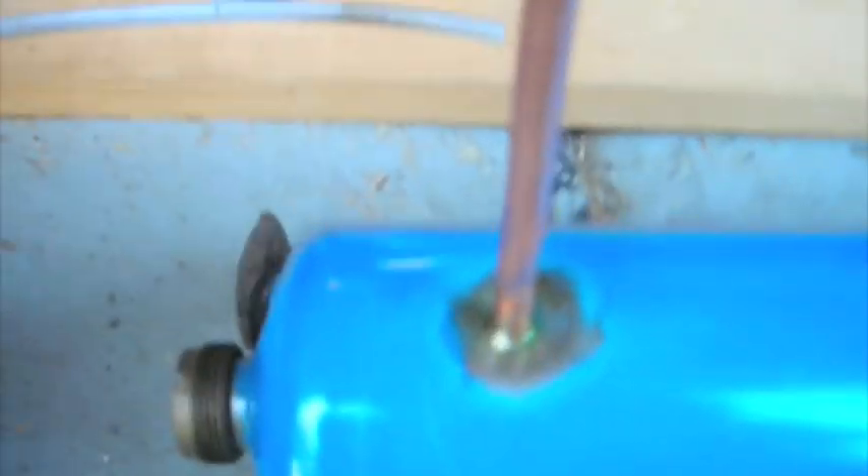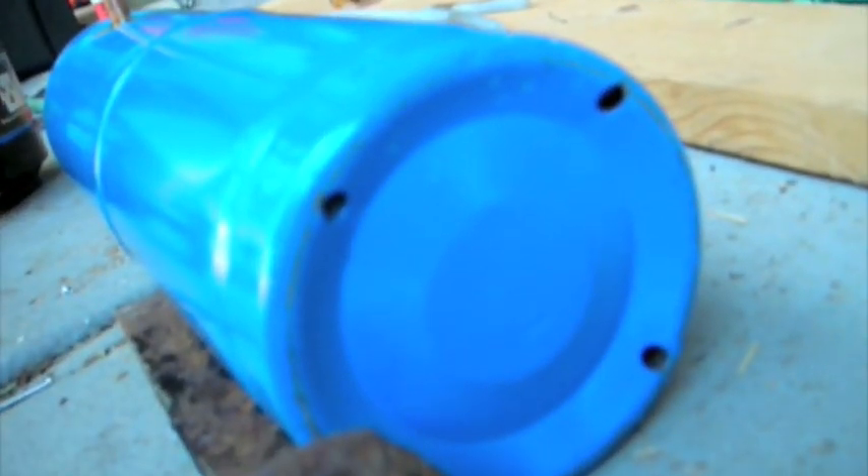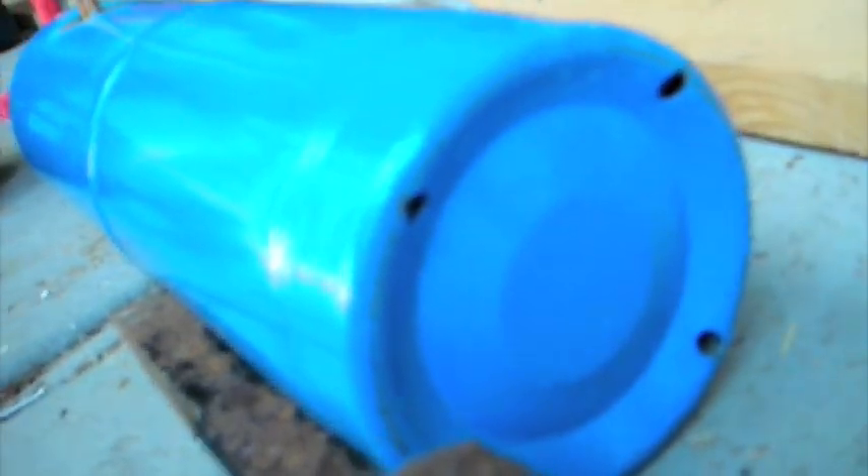Okay, let that cool. Just put a nice little bead of solder around there. Now I'm going to make the fixtures up here, and then I'm going to have to make a sight glass in the back, like my old boiler. That's probably gonna be tough because there's a two-step in here — like, this is a little thin plate and then comes the tank. So I'm gonna have to try that out.